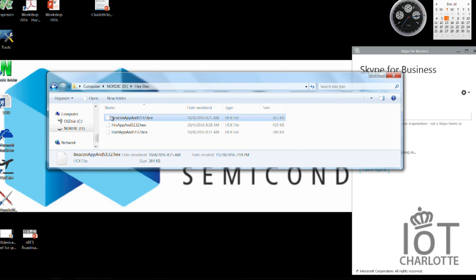So I mentioned the NFC, right? You can do this. All I did was take the NFC hex file and drag and drop it onto the thing, and I put this in there. So this is drawing 400 nanoamps. Right now, it's waiting for me to come along with my Android phone. Apple doesn't support this part yet. I have NFC on. There's nothing else going on my phone, just the OS. And I do that, and it brings up the web page. So you could ship your device with the part running, and when the person comes up to configure it, it wakes it up. At 400 nanoamps.